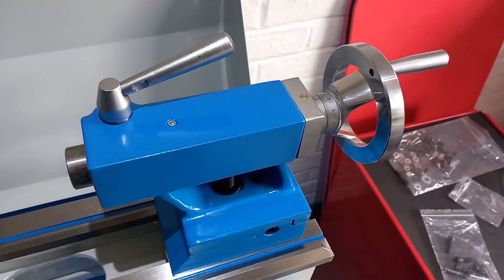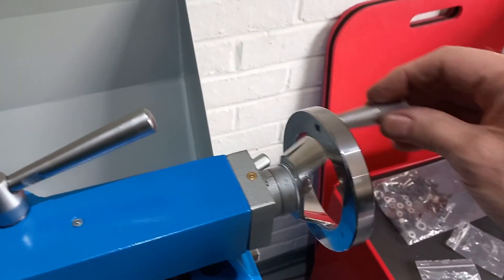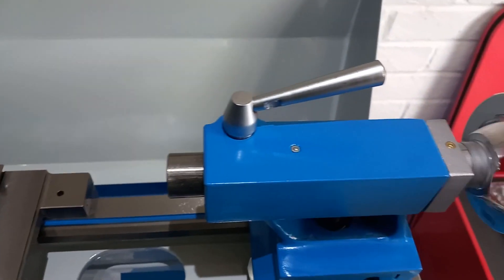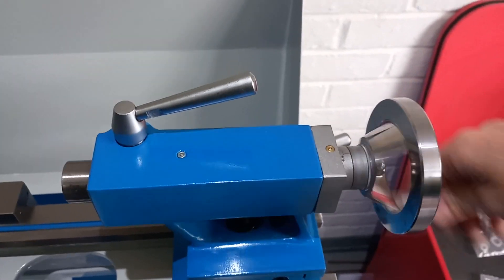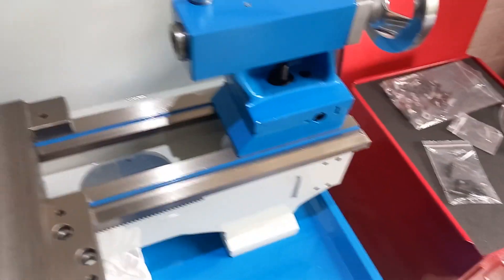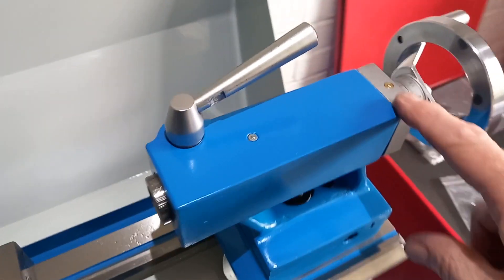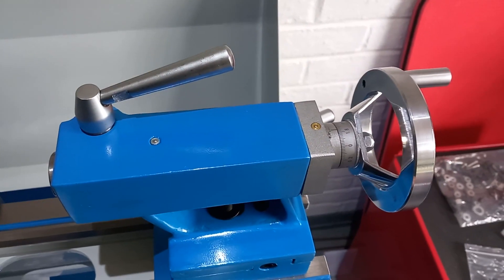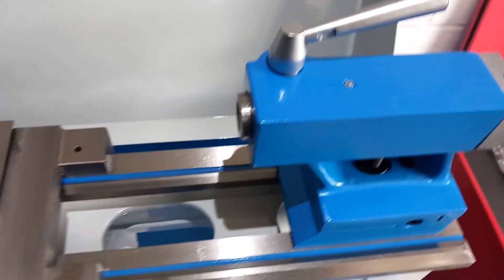The tailstock is finished — done my normal polishing of the aluminium, which will never look as clean, but it works very smoothly. I didn't put any oil in there, I just put grease in. I can't see anyone ever using that oiler, because all that will happen is the oil won't go anywhere near the bearings. That's a different matter — that's useful to oil the quill.